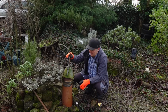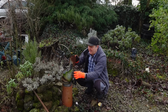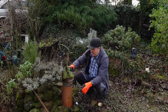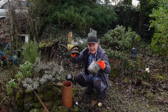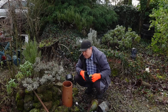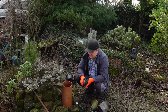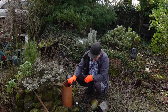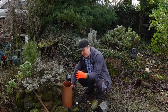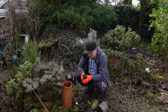That goes in there. It also tells you what direction the wind is. You know, you've got a little arrow on there. I think these are great. So yeah, I'm well pleased with that. We'll clean that up and we'll get that painted. We'll get this out. I'm going to run a tape over it, make sure. Perfect. 15 centimetres. So our flue liner will go on underneath and just sit roughly about halfway, so it's nice and snug.